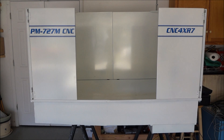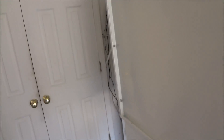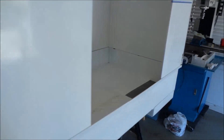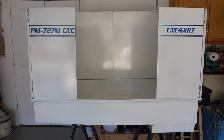One thing I noticed when building this — we had to assemble it before any priming and painting to do some finished welding and grinding — it's very loud when you're inside there trying to grind. So I know once the mill gets in there and you start cutting, it's going to be like a megaphone inside. What I'm going to do is get some three-quarter inch foam insulation board, cut panels, and fill these panels in with the foam insulation. That should help deaden the noise and that tinny sound.